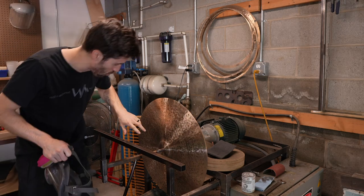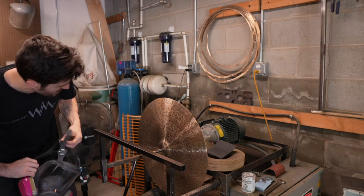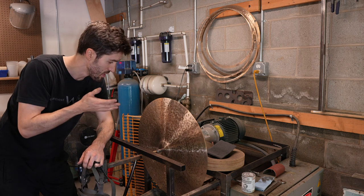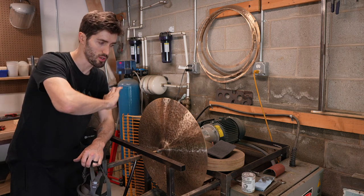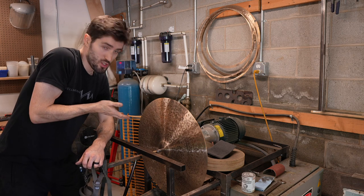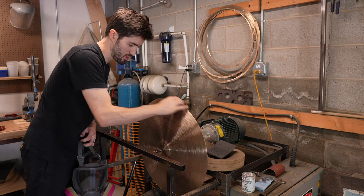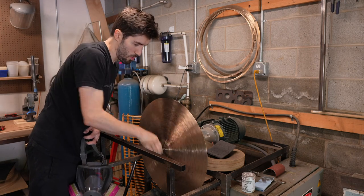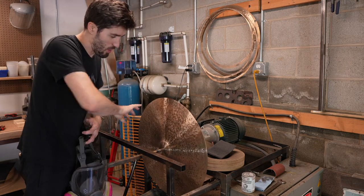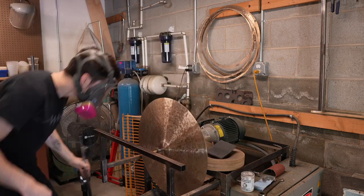You can probably see there weren't a lot of solid streams coming off, and that's the first thing that I'll do if I'm really trying to make minor adjustments on the lathe. I won't actually press in to get really connected streams that are really thick and heavy. I'm really just, like I said, scraping the surface. So I'm going to tighten this up a little bit because it was slipping, and maybe do one more pass where I'll put in a little bit more force. That way I can actually see a stream coming off my cutting tool.